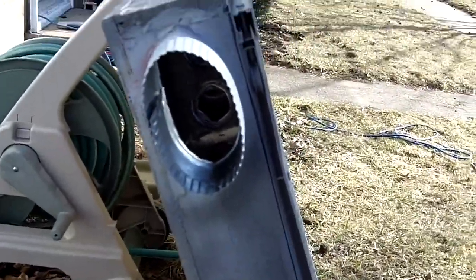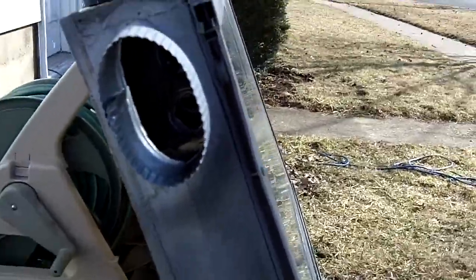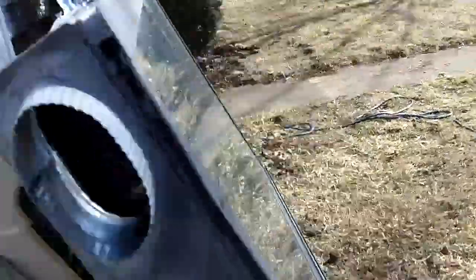So we're back to 91 degrees. It took a little bit less than two minutes. The airflow was a lot better. A quick calculation in my head would show, just for the cans themselves, that'd be roughly 72 CFM to push through that.